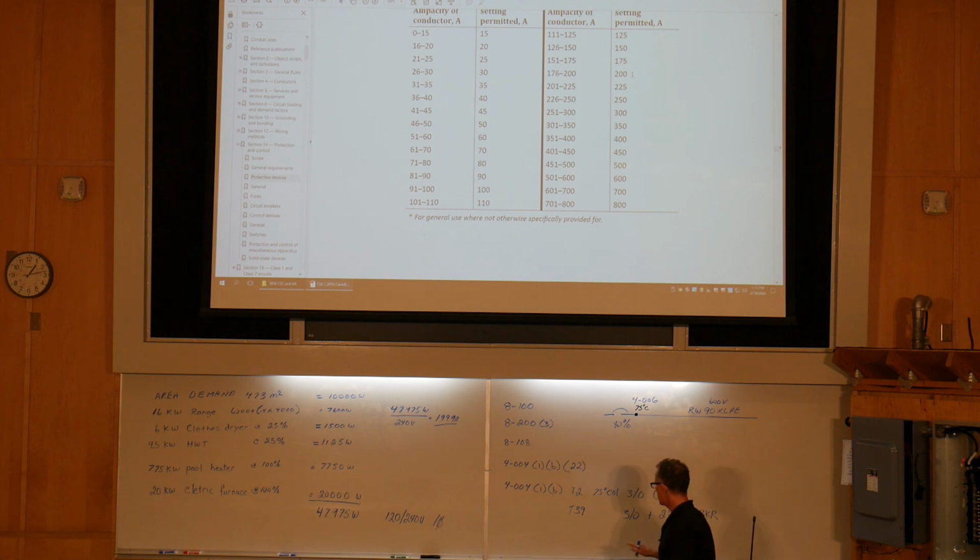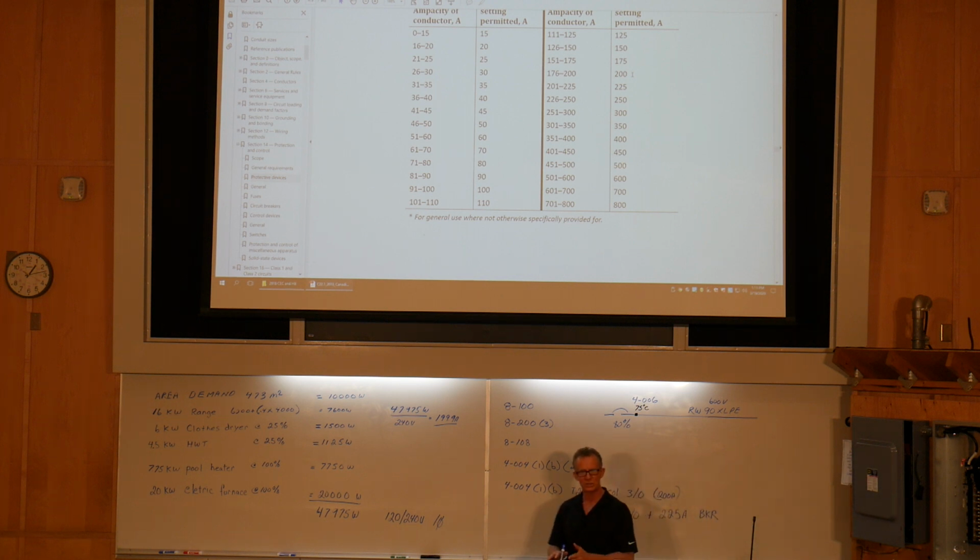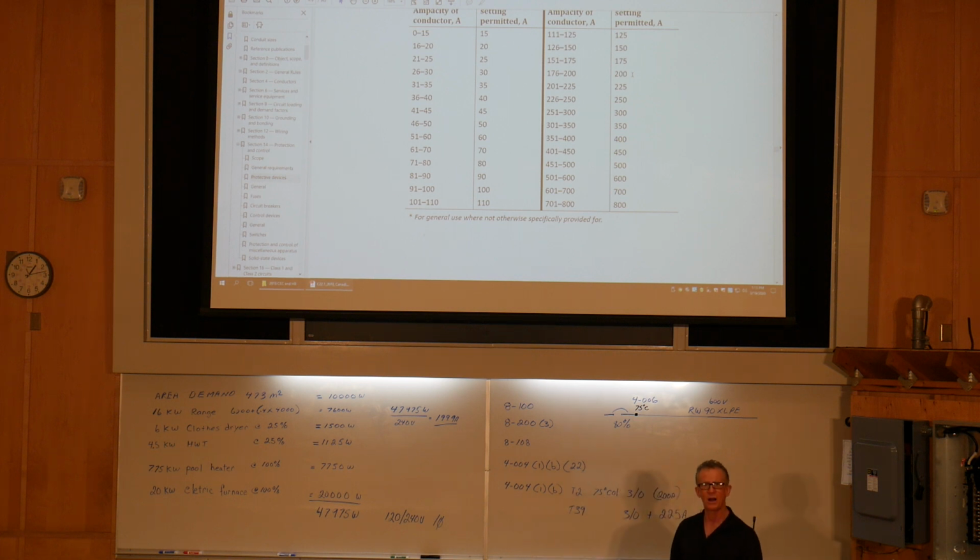Remember, when you're in table 39, it is restricted to single-family dwellings and feeder conductors supplying the row housing, etc. It's in the heading of the table. Make sure you meet the requirements of the heading to apply it. All right? So that takes care of that. In the next video, we'll look at the branch circuit for the range and the dryer.